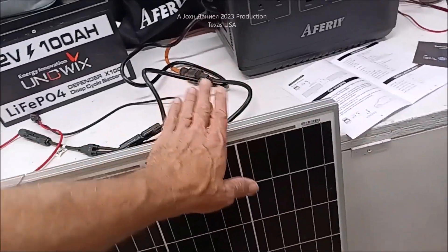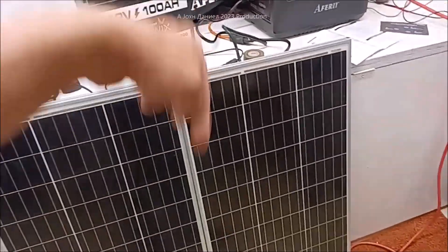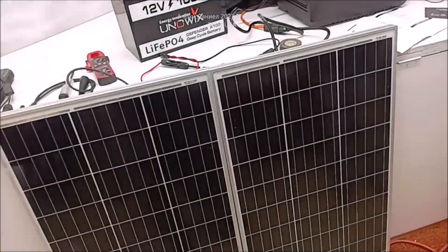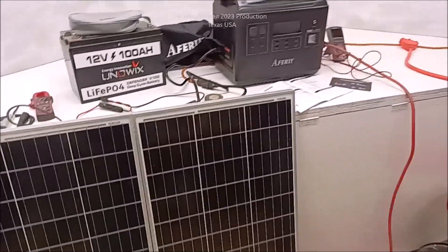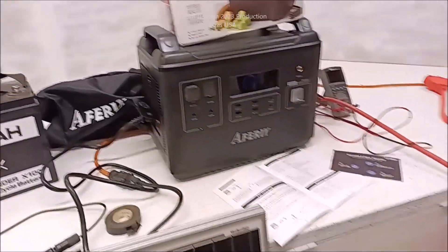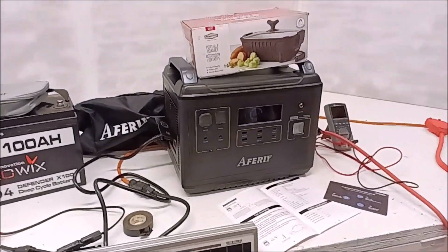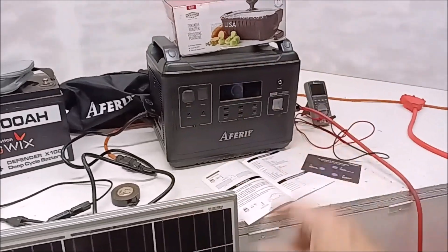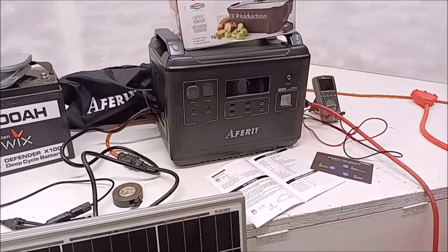Get the 5 bus bar, get the good ones, get the right ones. Don't pay the extra $20 for garbage — they're too thin, the glass is too thin, and there are too many fracture issues and recalls. Get the link I put below. Get a four-pack — $280, $275, whatever it is. And don't shortchange yourself by getting a 1,500-watt unit thinking that's enough. You need 2,000 watts to run a 1,500-watt microwave.